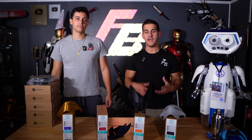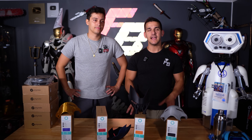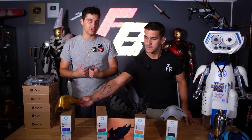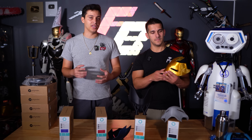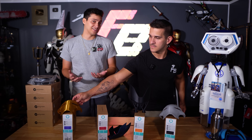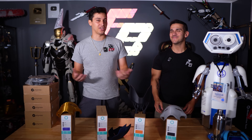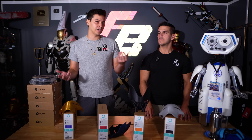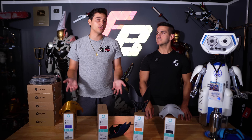So with the health and safety stuff out of the way, why ABS and ASA and why now? Pretty much everyone knows PLA for 3D printing, but back when I got started in late 2016, PLA was still pretty new-ish. While it was regarded as the easy material to print in, it kind of just sucked — the standard printing temp was like 190 degrees as opposed to the 220 now, and it had a lot of flaws. Most printers being sold semi-professionally were being sold to print ABS, as it was the more common and well-used plastic in the industry at the time.